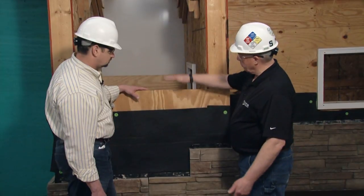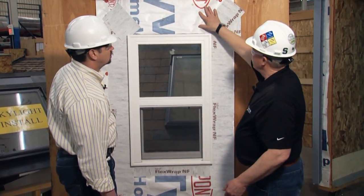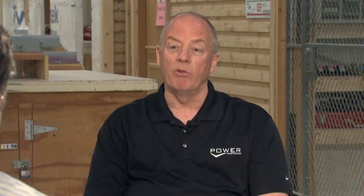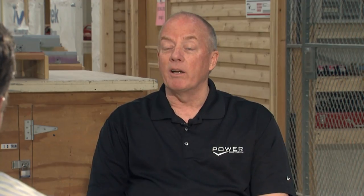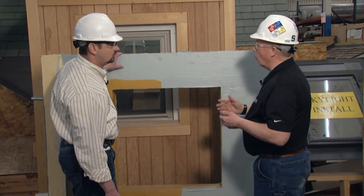Every three feet in your building, you've got a seam that you need to deal with — either lapping it in the right direction or dealing with that overlap. Then they came out with building wrap products that became bigger sheets with fewer laps and conditions to manage. And now we see technology moving into peel-and-stick products that stick themselves onto the building without putting fasteners through holes in your system, and even seamless products now — either spray-applied or roll-applied — where you have no seams, so it's a continuous barrier.